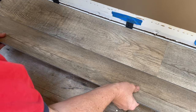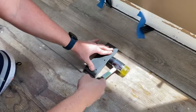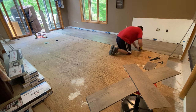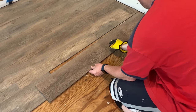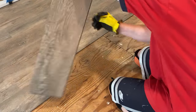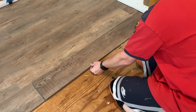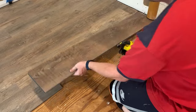The brand I'm using is Mohawk — not a sponsor, we have 50 subscribers — but it's vinyl plank flooring. Their system is called the click-and-lock system. Other brands have a very similar system with their own name for it. When you come to an end piece and need to measure it, you can't put it up to the wall as-is because you need to preserve the locking end. Just flip it around, put the locking side against the wall where you need it, and make a mark on the other side — that's where you cut.